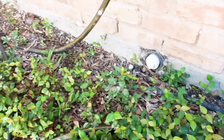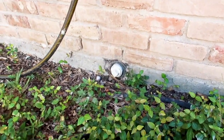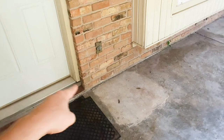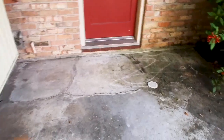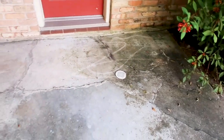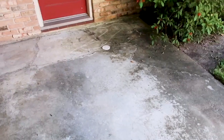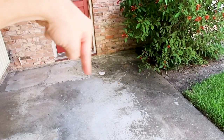One thing I've learned in my sewer scope class is if you see a PVC cleanout in a cast iron pipe, you should be asking yourself why it's there. We'll definitely recommend a sewer scope scan or hydrostatic test on this property. If you see patched squares like this, you know the foundation has had previous work. There's a cleanout in this area — that's how water was flowing into the structure. They must have had a water issue, so if they have the sewer scope camera out, they can scan that too to make sure it's clean and not crushed.